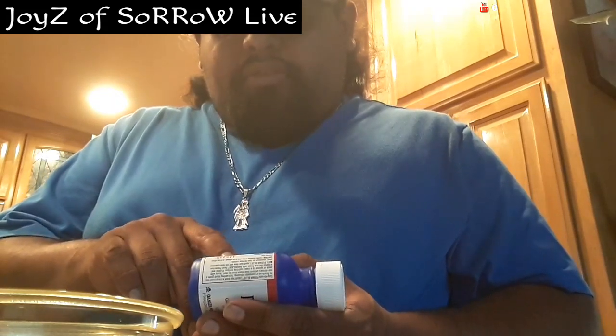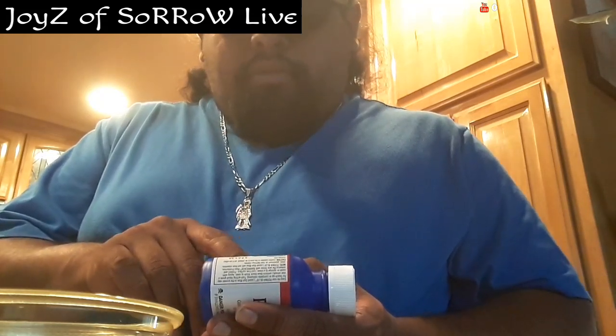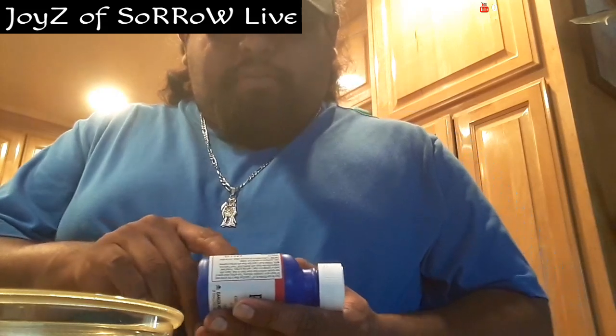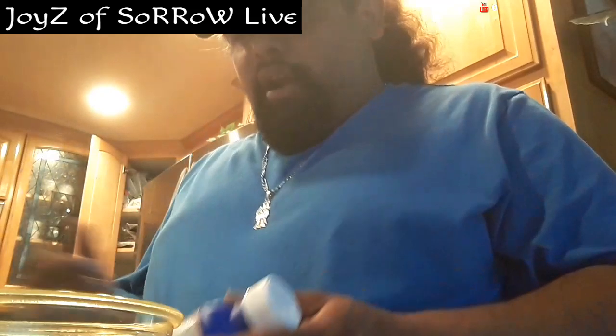Apply blue with saturated swab or sponge. Allow it to work 1 minute. Rinse in cold water and wipe dry. Okay, lightly buff with steel wool. Repeat steps 4, 5, 6, and 7 to obtain a darker blue. Okay, so I'm guessing the more I would use it, the more darker it's going to get.